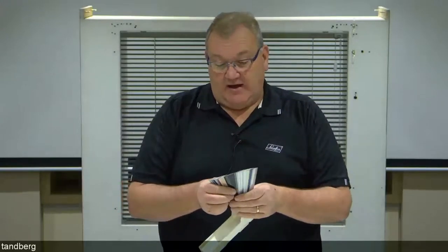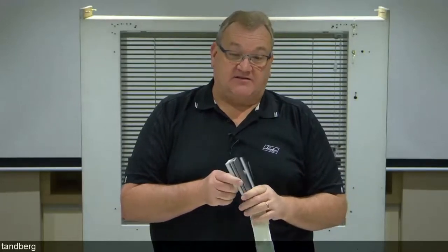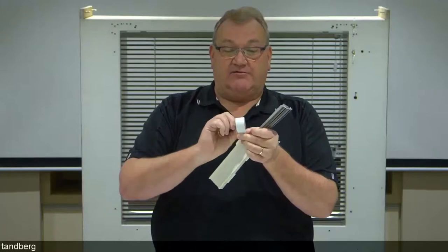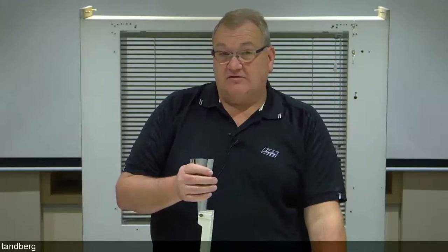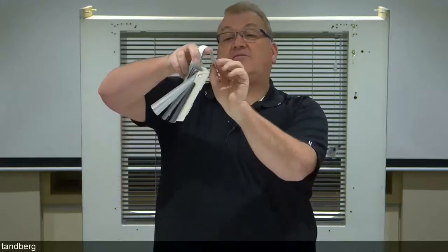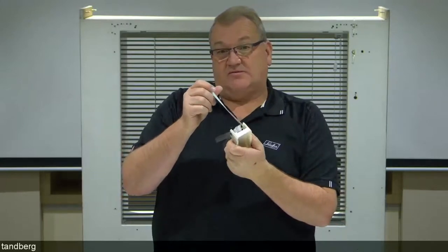One of our really strong points with our Aluminium Venetian product is the integrity and stability of our 25mm slimline Aluminium Venetian slat. You can actually get the slat and bend it around completely and it will still flex back. Don't be afraid to show that to consumers when you're showing them the swatch. Don't do it for the 50mm, but certainly the 25mm. The 25mm is designed so that it can be bent around 12.5mm radius and still bounce back to its original position.